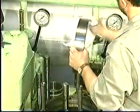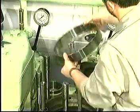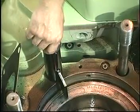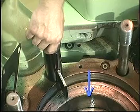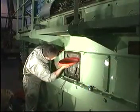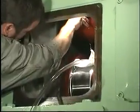If the liner is designed to hold a flame ring, clean and reinstall the used flame ring before honing the liner. Mount the tool for holding down the cylinder liner and remove any deposits or wear ridges from the upper part of the liner. Fit the drain funnel to the low end of the liner to prevent contamination of the crankcase during honing.